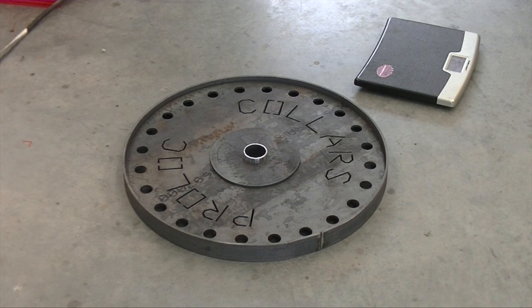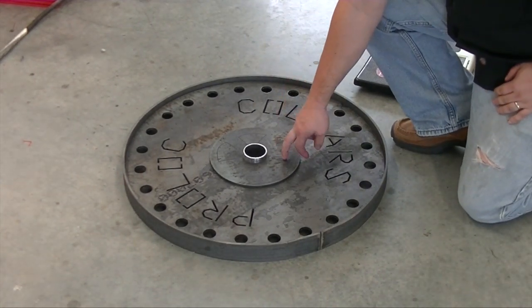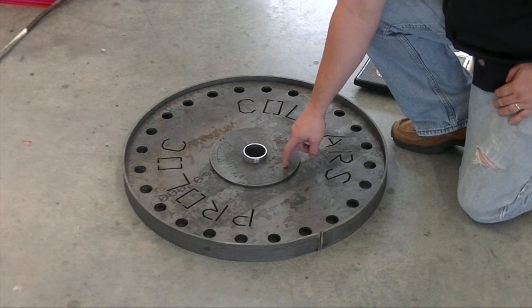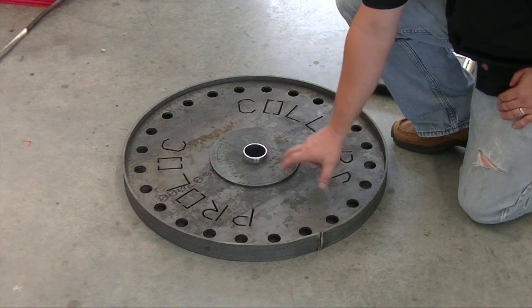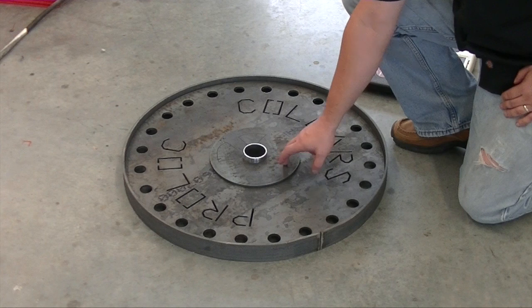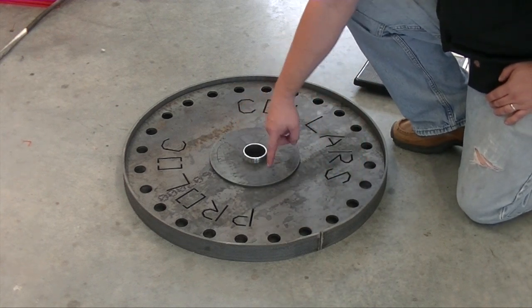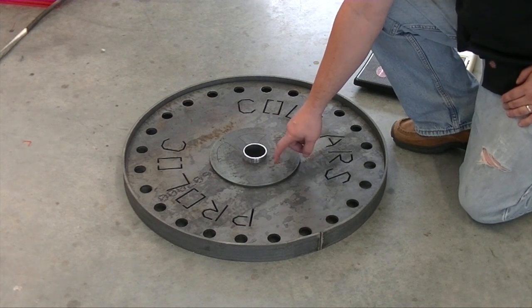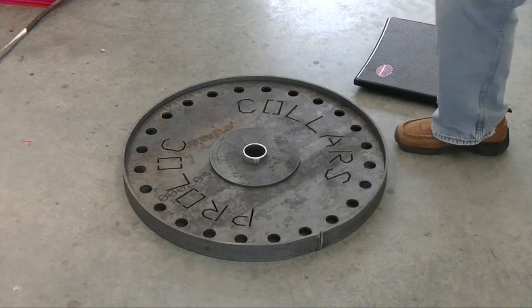What I'm going to do is for those center rings — let me come around and show you what I mean. I'm going to change this design on both of them to get the weight down to where we want it, because there's one on each side to provide strength and it changes the flex point, giving us a much stronger weld holding everything in place. We've got to be a little under where we want because when we weld it we're adding some material back in.